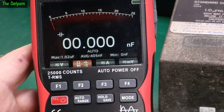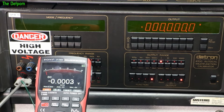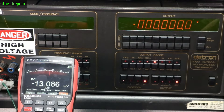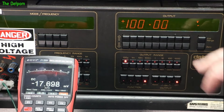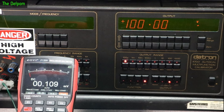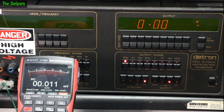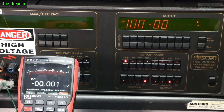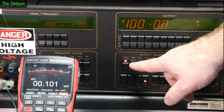Now at the calibrator, starting at low levels — millivolts first. We're doing 100 microvolts. There's a small offset, so we'll null that out with relative mode. At 100 microvolts it's basically bang on. One millivolt: bang on. There's a little bit of fluctuation — there's some AC noise present in the environment, which isn't surprising.